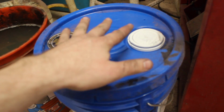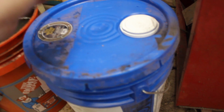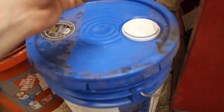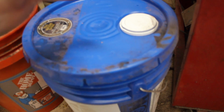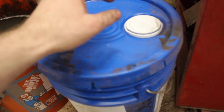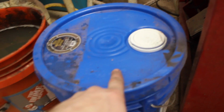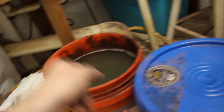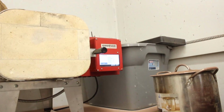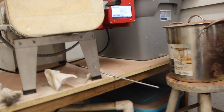Glass hardness every time. I have some Suminagashi, I think that's how you pronounce it, some Hitachi white and Hitachi blue, and some sanmai with them as well. Those are going to make excellent hamons. Not the sanmai, but the pure steels. And so I'm really excited about this Parks 50. Let's see. We are at temperature, so that's going to be 10 minutes. I will see you in 10 minutes for this quench.